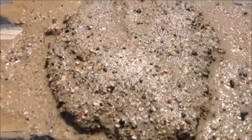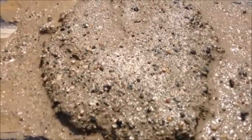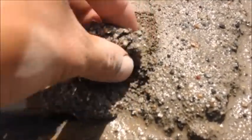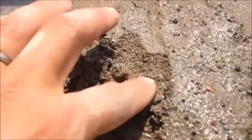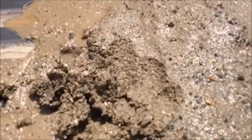Here is some of the material that augered up and out of the sand screw. You can see it's anywhere from maybe eighth inch particles down to about 40 or 50 mesh. And then here is the 50 mesh minus.